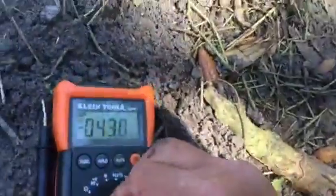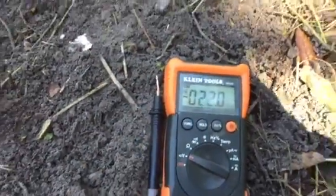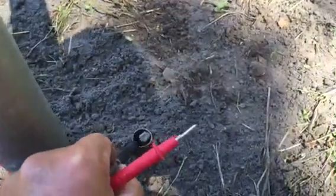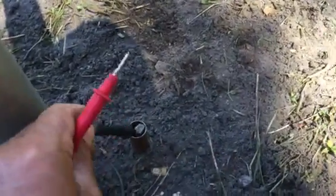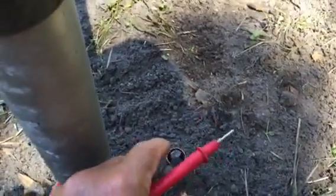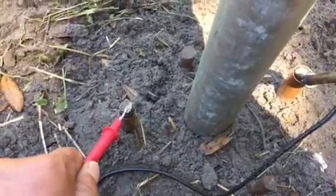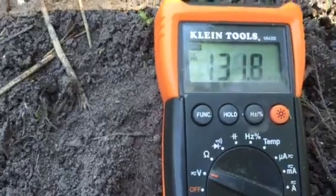and these are just straight up iron. Now I go over here, I'm going to turn the voltmeter on, put it to DC, and we are going to test just these right here and see. So we're going to stick the negative over here. Let's get it so it's touching the metal as well as the copper, and then here we're just going to go ahead and touch the metal in the middle, and we are climbing.